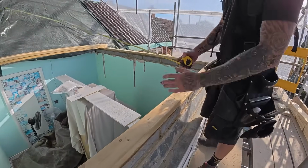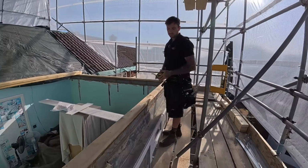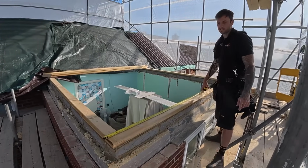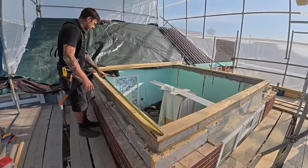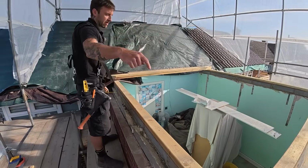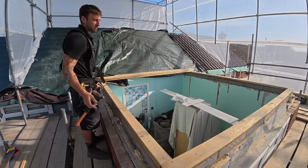That's where our crown common rafter goes, so it'll meet the ridge and the ridge will return back to the main house. So if we come off to the edge of the rafter, I've got 1562. If I come off that, the same here, 1562, and then put my X on the left. We're parallel at 90 degrees, so the hip will run up at 45 degrees.